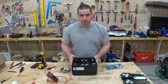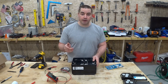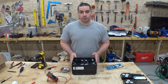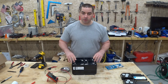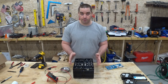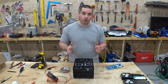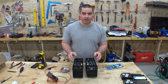We'll address that — it might be in a future video. Some people do run systems at higher voltages. I have a friend Ben up in Vermont — I made a video about his system. He's running an MPP Solar PIP-GK, which goes up to 64 volts, so he's running in the low 60s for his battery pack voltage. If he was to take three of these modules together, that would actually be a really nice system for his higher voltage setup. Most of us running a nominal 48 volt system are typically going to be running the low 50s, between 48 and 56 volts. Right now I am really pleasantly surprised with how perfect these cell voltages are.